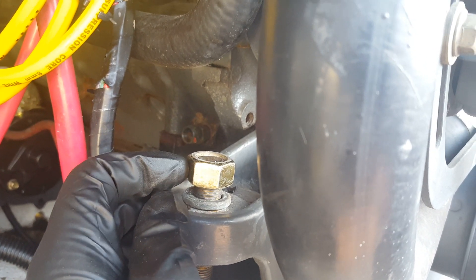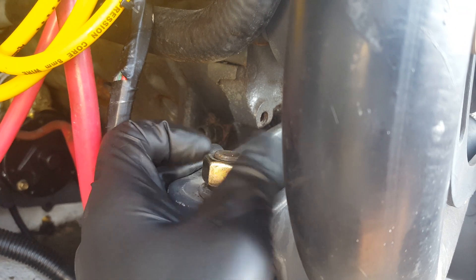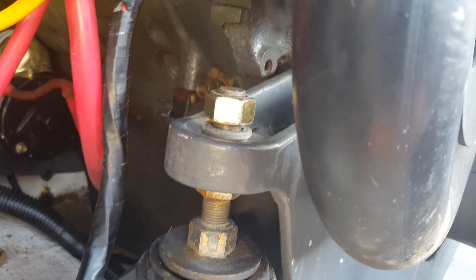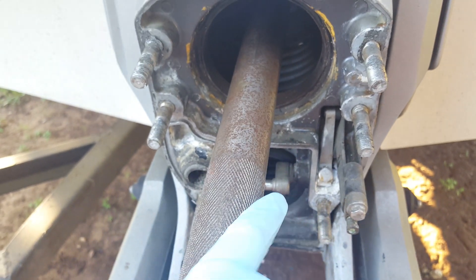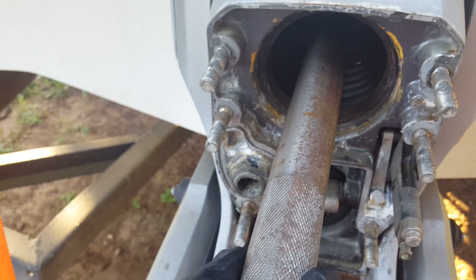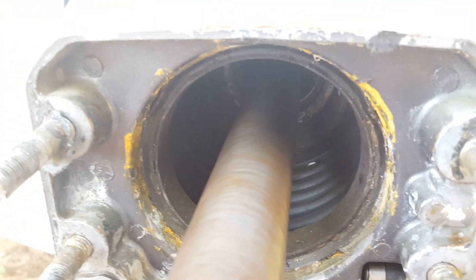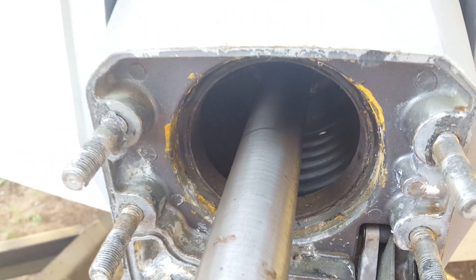My helper says we're good to go, but before tightening everything down let's go back and see what the effort actually feels like. My helper is 12 years old — see how effortlessly the tool turns now. Two fingers. That's what you want. This is a must for yearly maintenance when you pull the stern drive off — if you don't do this, say goodbye to your gimbal bearing.